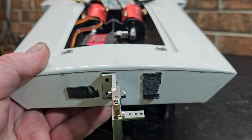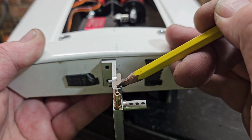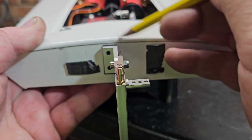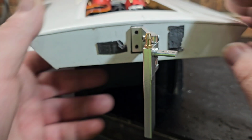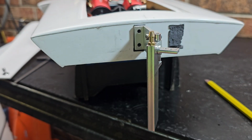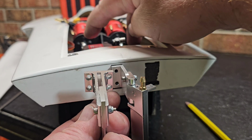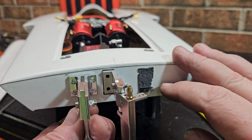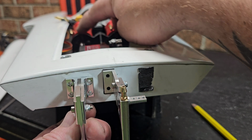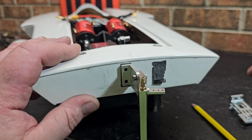It's not really the best rudder center mount, because the bracket's all set, the pins. So we got to make sure this pin right here is dead nut center on our center line. I was kind of contemplating my motor width from one another, the distance they are, 60 millimeters. I was thinking about running 65 on my struts, 60 on the motor, 65 on the struts, and just kind of putting a slight S-bend in my stuffing tube.